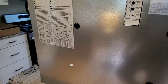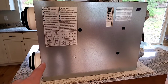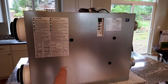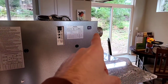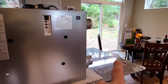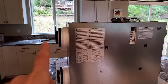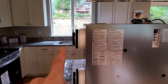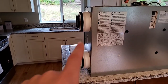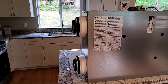Looking at it from this side, we have outside air coming down here — you'll see an enthalpy core in there — and that's going to supply the house. There will also be a duct bringing in return air from the inside, and it will be exhausted to the outside. Now, we wouldn't want recycling of air, so we have to have the two exterior points separated. 10 feet is the number to use there.